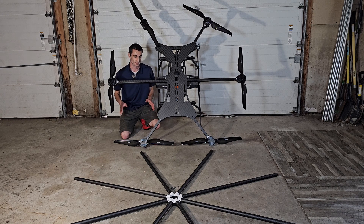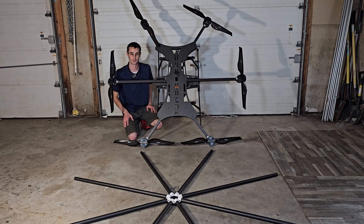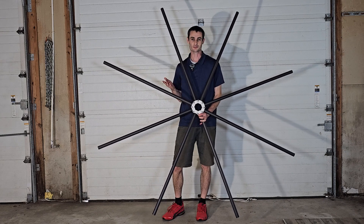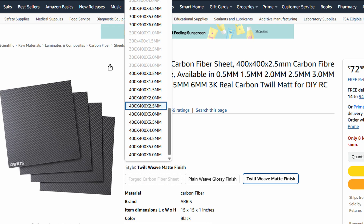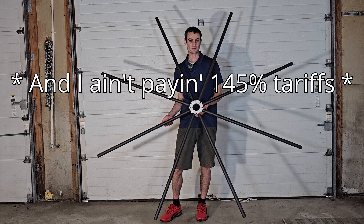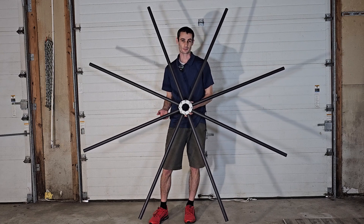The giant octocopter I'm proposing is going to look like a freak of nature unless we do something about that. Really big sheets of carbon fiber are extremely hard to find unless you have them custom made or custom build them yourself, which I don't have the money to do right now. So instead I'm going to build the biggest body I can with the materials I already have. The biggest 3D printer I have is the Anycubic Chiron — it has a build plate volume of 400 millimeters square by 450 millimeters tall, which coincidentally is the biggest size of carbon fiber or fiberglass plates I can find on Amazon or anywhere on the internet without ordering something custom made. So I'm just going to design the biggest body I can in Fusion 360 that will fit on my Anycubic Chiron.